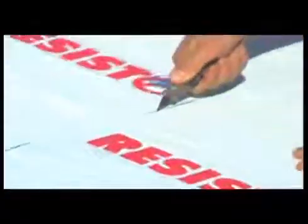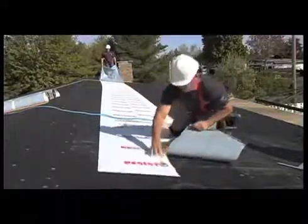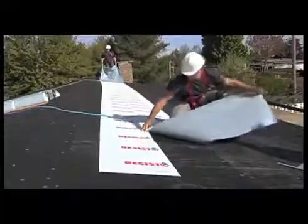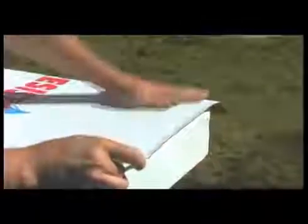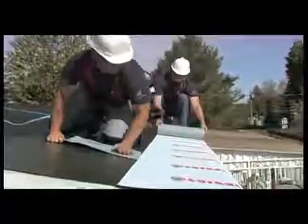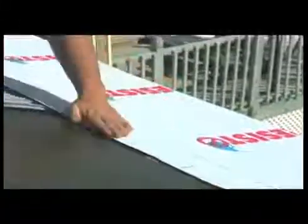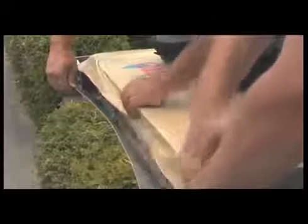This first row is different from all the others. Cut the first membrane down the middle of its entire length. Begin installation of the base sheet membrane at the base of the main roof. Only half of the base sheet membrane is glued in this row to avoid an overlapping of the joints between the base sheet and cap sheet membranes. If you're working on new construction, let the first strip overhang the base and sides of the roof by about three inches. If it's existing construction and the fascia is already in place, align the membrane with the edge of the roof.